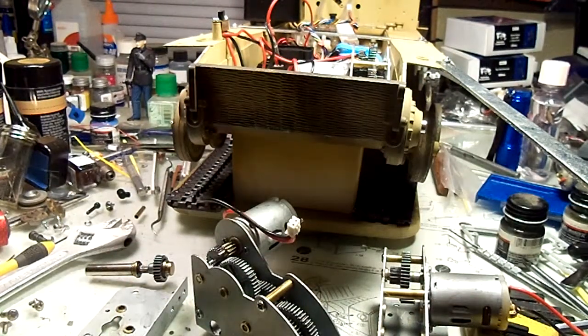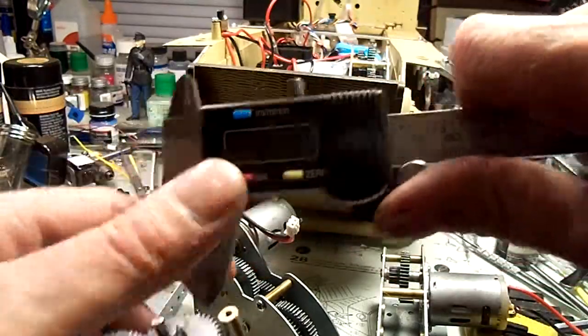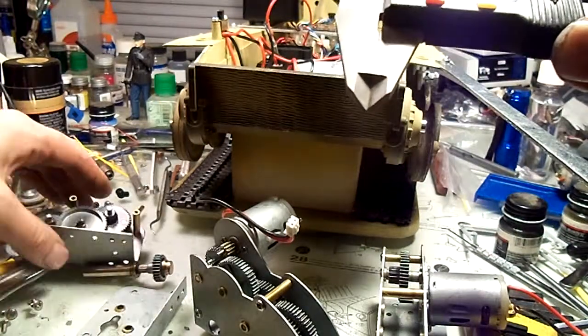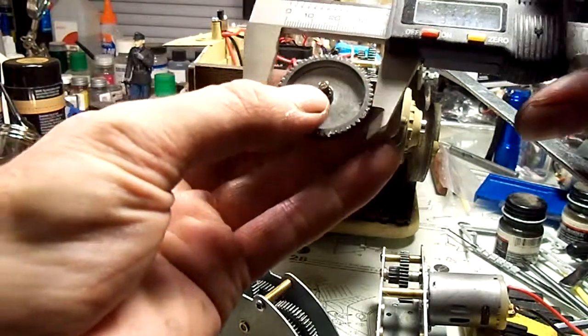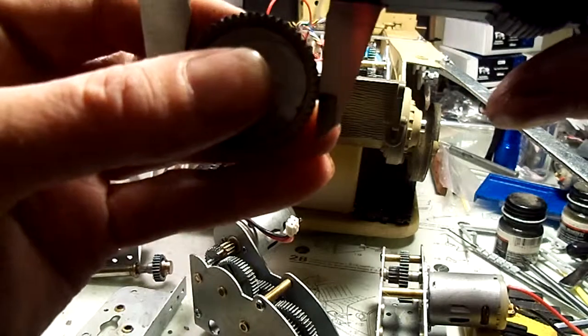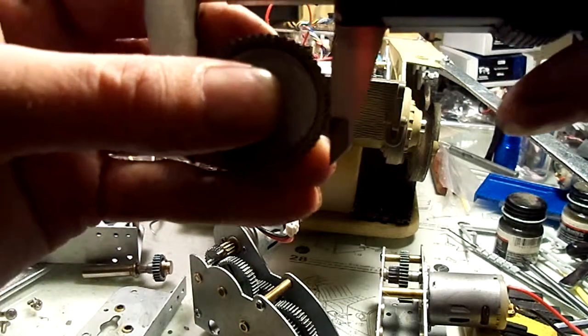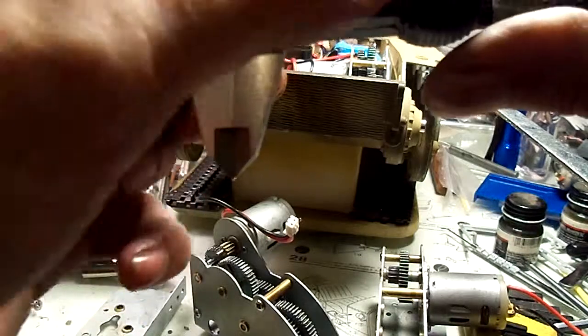If there's any doubt, let me show you how you check gears — I told you I'm in the gear business now. There are a couple of different measurements that are important. These are your calipers. When you get one of these gears and you've got two of them, you want to compare them to make sure they're the same. Check the OD — this one's at 1.298 inches. It's probably metric, so we'll flip over to millimeters.